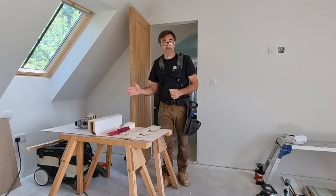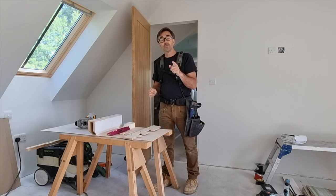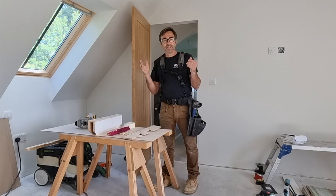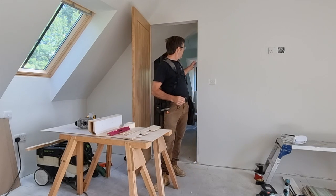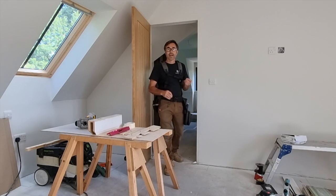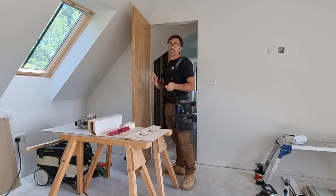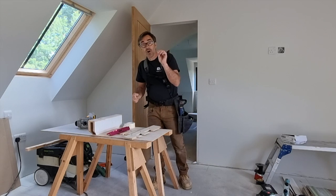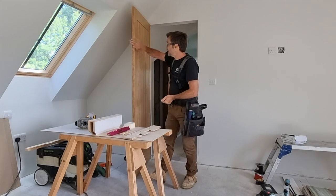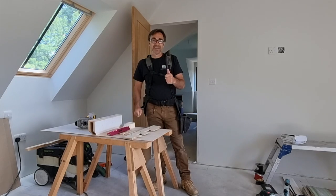I hope you've enjoyed this video. Take your time, read the manufacturer's instructions about how to store, stack, handle, select, and most of all make sure your frames and linings are in good shape. You've always got a little bit of tolerance if the architrave isn't on — our linings are screwed, so you can ease the screws out, ease it away, put a shim behind, put the architrave on, and it's a really nice bit of adjustment. These linings come pre-trenched — they've determined the width of the legs and they are bigger than the doors. Please subscribe to my channel, thanks a lot.